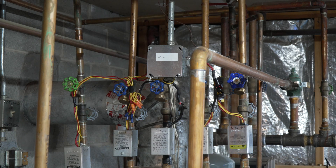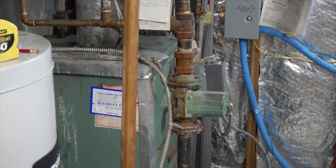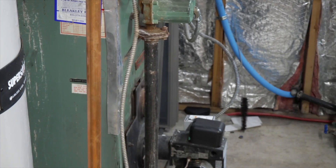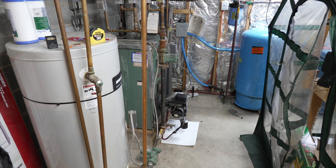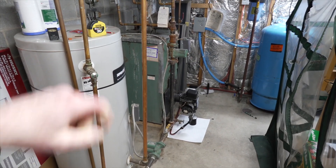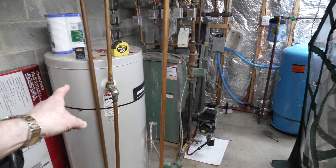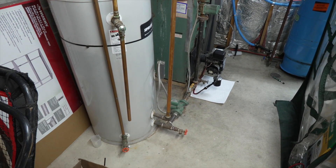The boiler can be on or off depending on how hot it is. I have the boiler set pretty high because of the garage heating—I've read it's to your benefit to have the boiler heat hotter. I have it at about 205 or 210 as the high limit. I have a triple aquastat over there from the days when I had a tankless coil to heat the water. Now I have this tank and it's on its own zone down here with another circulating pump.